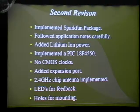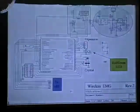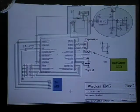The board was actually also designed, I'll talk about the board later, but this is the schematic of the device. On the bottom, it talks about 2 NRF because the circuitry for the NRF is the exact same as before. The only thing I changed was instead of a CMOS clock, I used a crystal, which solved that problem. But this is actually a basic crystal resonator.